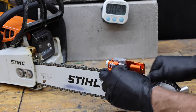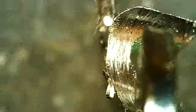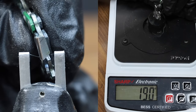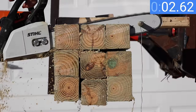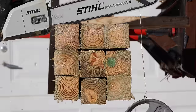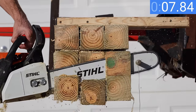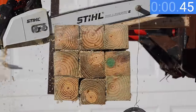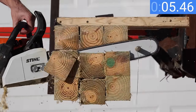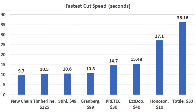The carbide burr on the Timberline does a fantastic job removing damaged metal without heating the chainsaw teeth. However, it is a slow process at just over 15 minutes. The burr still looks as good as new afterward. The chain is extremely sharp, and the sharpness tester confirms it with a score of 225 — by far the sharpest yet. In the log test, the first cut finished in 11.1 seconds. With the burr worn off, the Timberline made the fastest cut of all sharpened chains at 10.5 seconds, and repeated that on the third cut at 10.5 seconds again, holding its edge throughout.